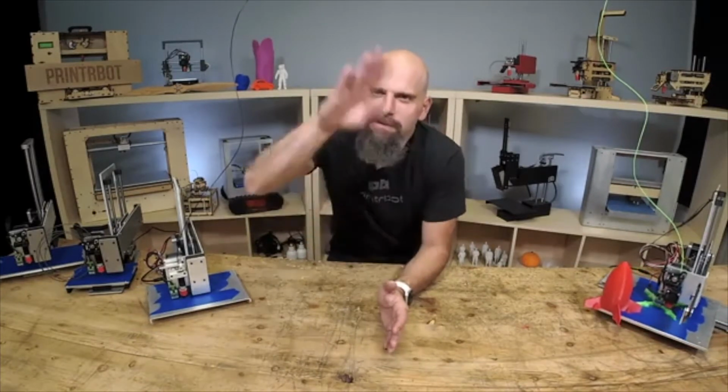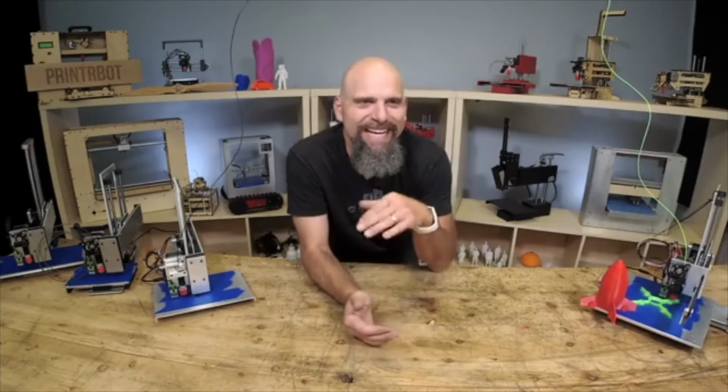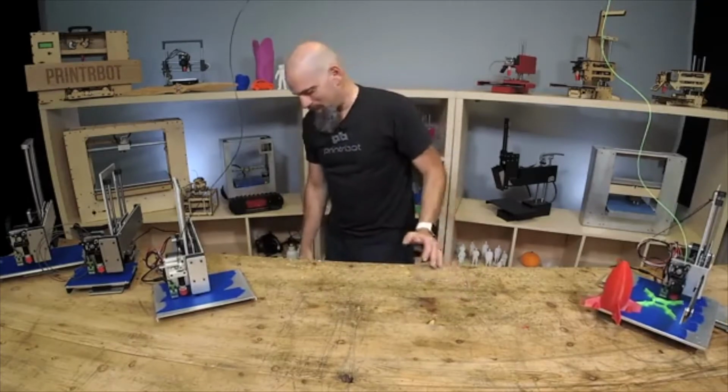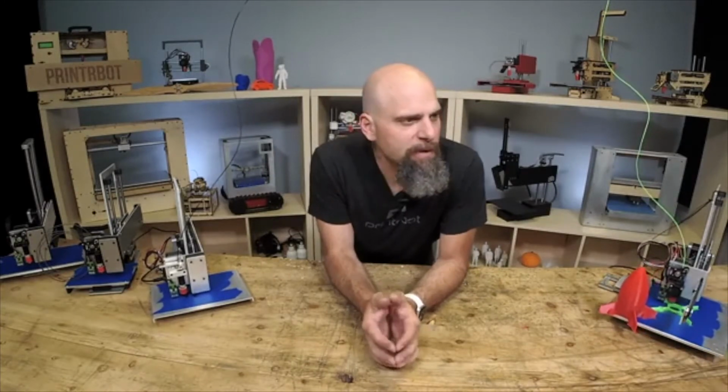Don't plug it into your car lighter while the car's running, because the voltage is like this. It needs a pretty steady voltage. So I recommend a voltage regulator, but I've done it without it. We have some of those batteries around, but I don't have one with me. I thought about walking around at Maker Faire with some of those smalls on battery power.